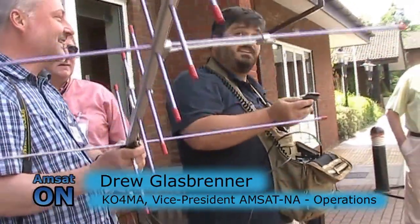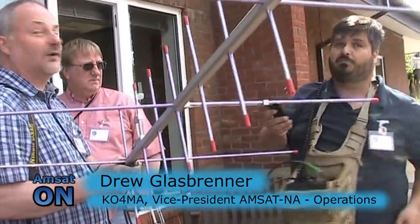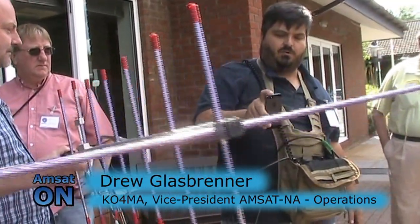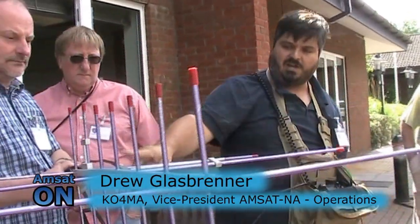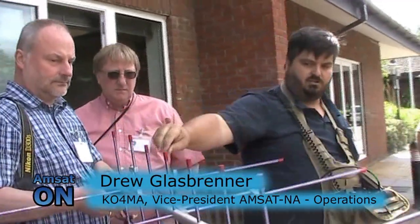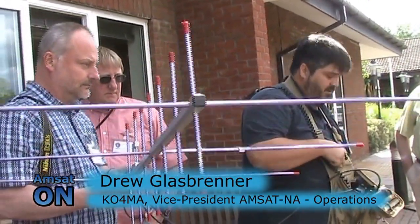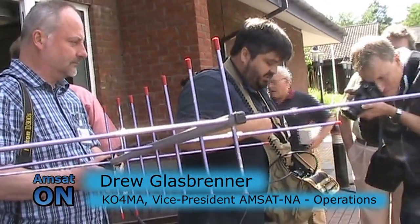Alright, we've got about 3 minutes to go. We're going to be working FO-29. Actually, we've got more than 3 minutes because it's coming up from the south through the building. I'll probably step out into the parking lot, but it'll take me a few minutes to get over the building. What I'm using here is an Arrow antenna, a 2 meter, 70 centimeter Yagi. I'm not using the diplexer. I'm using good quality LMR 400 and RG8X cables. I've got 2 817s in a bag, one for transmit, one for receive. One's on 2 meters, one's on 70 centimeters.